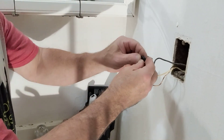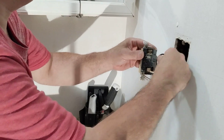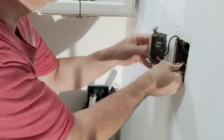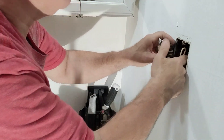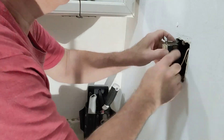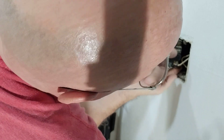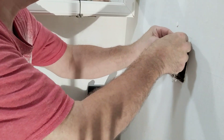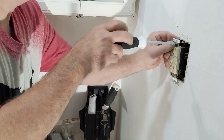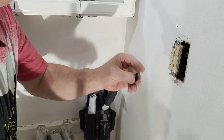Because this box is at an angle, I'll try to close it. Now that's going to be flush. So now we can fold our wires into the box. I'm going to keep this ground wire zigzagging across the bottom so it stays down away from everything. This is a nice deep box. We'll put the single layer spacer up here on the top, and the one we fold over and snap together down here on the bottom.